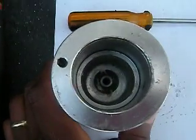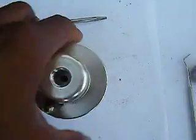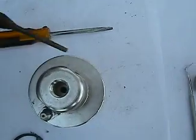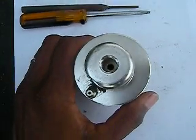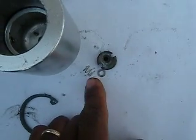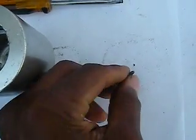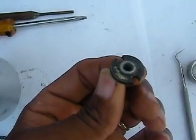So this is the other face of the mechanical seal in there. You're going to see that's going to come out. I use my pin punch to push that out from the reverse, the inlet of the swivel, and then we got the mechanical seal. We got a stainless steel spring, a washer to support the spring, and a damaged O-ring on the mechanical seal. And this is the mechanical seal face.